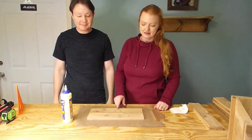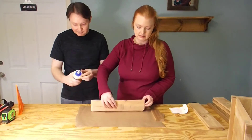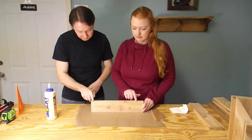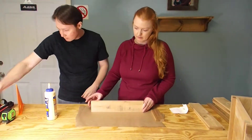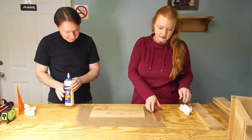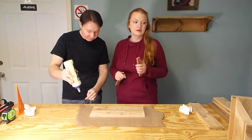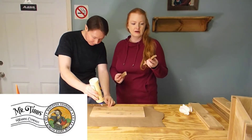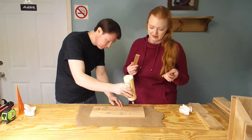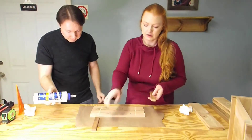We're in the home stretch — this is going to be the front panel of our box. What we're going to do first is glue together the joints. Then we've got a couple of places marked here — these are going to be some strips to go on the outside. The customer wanted to have an inverted frame so it looks like an old-style shipping crate. We're going to go ahead and glue these on, give it just a second to get tacky, then flip it over and nail it together.